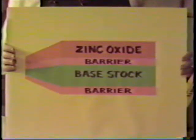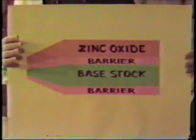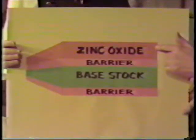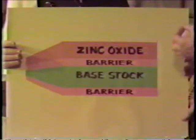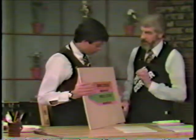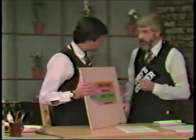on the top surface. Now that's what gives it the properties of photosensitivity and that kind of thing. We're going to get into that. We add something else to the zinc oxide, which I didn't show here, and that is called a sensitizing dye. Now that gives the material a property of speed, much like photographic film has. So different amounts of photosensitizing dye give it different exposure speeds when it goes into a machine.